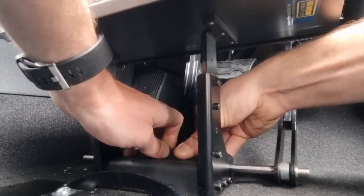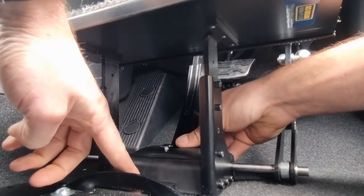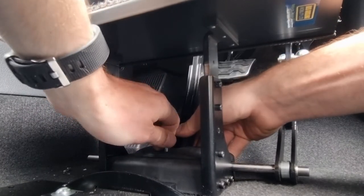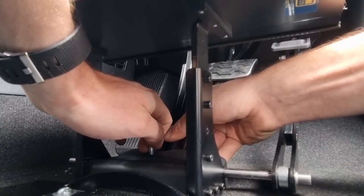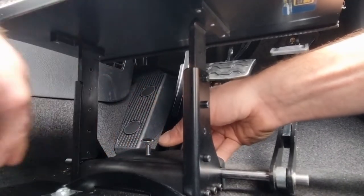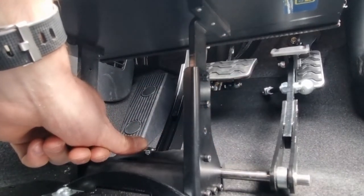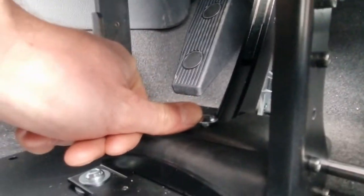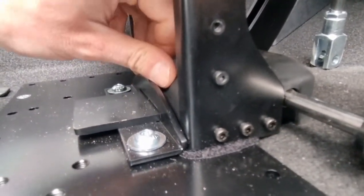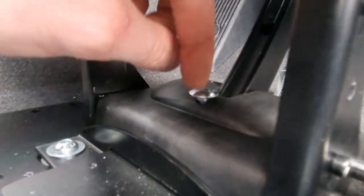Wiggling it as it comes back on, you'll see there's a hole in the base — you need to lift the pin up as the unit comes over that hole. Make sure it can slide far enough back so the pin is loosely above that hole, then let go and slide it until that pin locks in place. Having that pin locked is critical — it stops the whole unit sliding forward — so make sure the unit is tight up to the stop and that pin has dropped down.